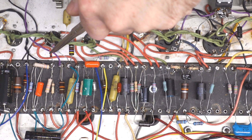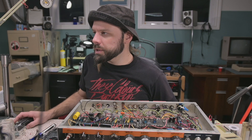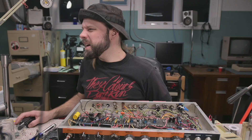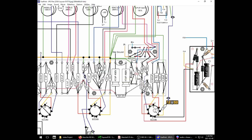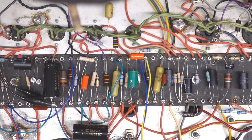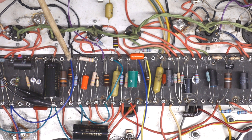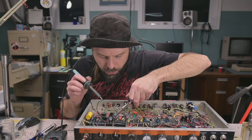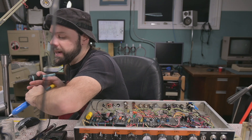There's a lot going on here. I want to double-check — the grid input should connect to a 47, a 100, and another 47. I see another mistake. This 100K should be connecting to the other side of this 47 — there's the 100K, there's that 47 junction. The 100K has to go to the other side of it. That means we've got to stretch this component over there — we're going to have to jumper these across. Took all this and moved it over one. Our configuration is starting to become less than ideal.